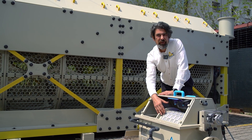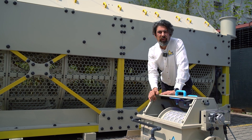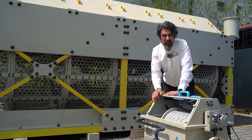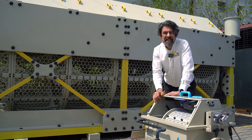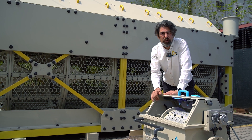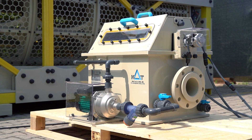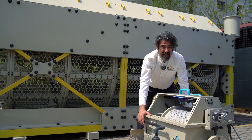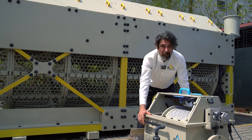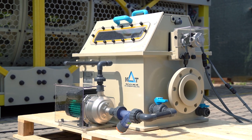You can also select your mesh between 10 micron up to 500 micron. We have mesh material options with food grade polymers and also 304-316 stainless steel and duplex materials. The DRF series includes two different types of mesh plate size, which means you can have just a few spare plates on site and use the same plates for different models for quick replacement.